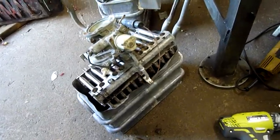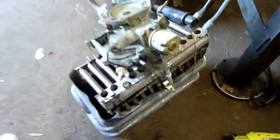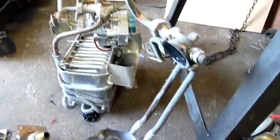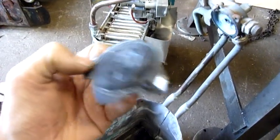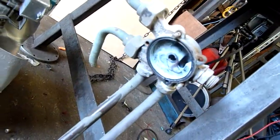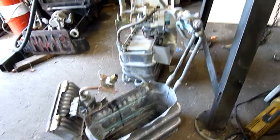And simply not heated — without pressure to operate the gas valve, it would have just done nothing. It would have got cold water and a lot of water pouring out the bottom of the unit. So yeah, it's dead. There's a bit of copper and brass, which is awesome. I can see a tiny tear on the corner of that diaphragm — that thing is a mess. That one I guarantee is the same deal, just full of water. But the other one, we'll do a full autopsy on a little bit later.